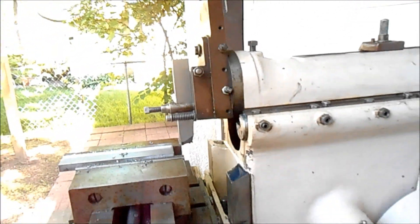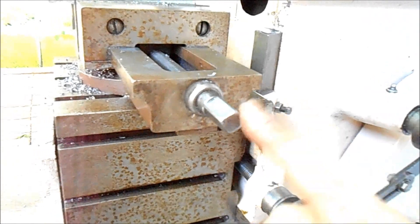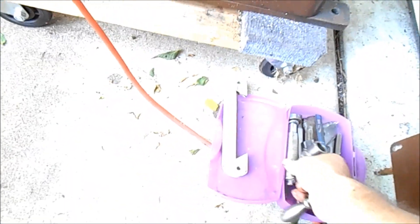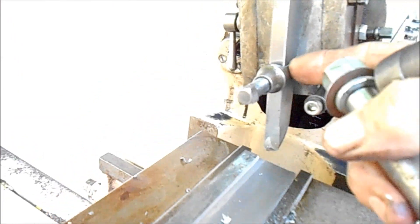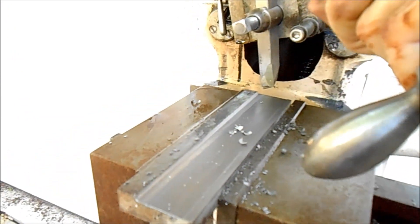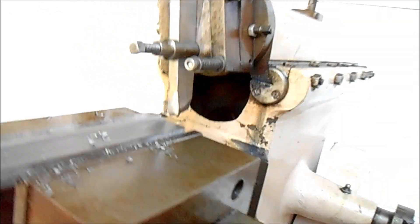I'm going to shut it off and we'll go over some of the controls. These are all half-inch square studs that accept the wrench — here's the wrench. It's got the original wrench. I should point out, too, that the vise has the original angular table; one can mount that on here. It's got the internal key cutting toolbar. This actually mounts — I believe it's going to replace this part of the lantern tool post — it should just mount right in there, and then you can cut a keyway with this. It actually looks set up to cut almost like a threading tool on there.